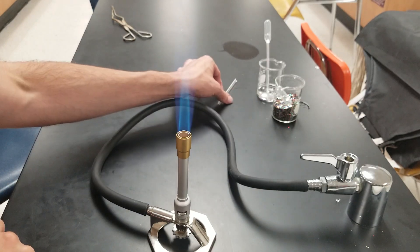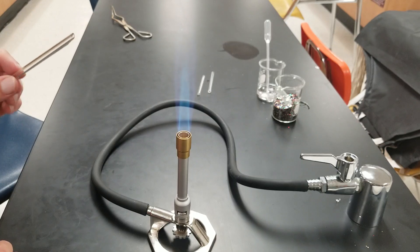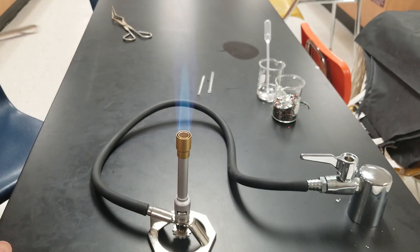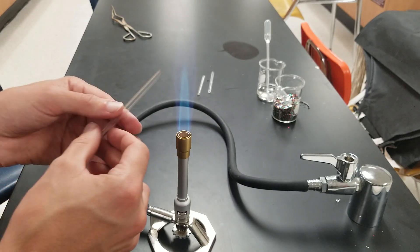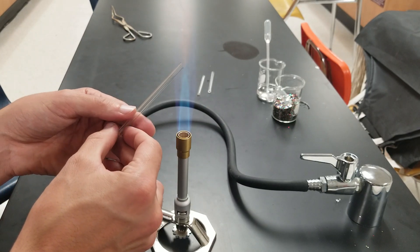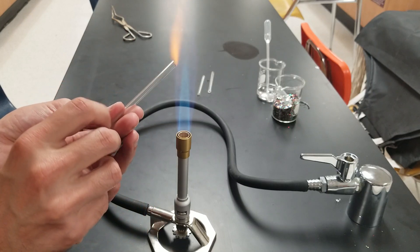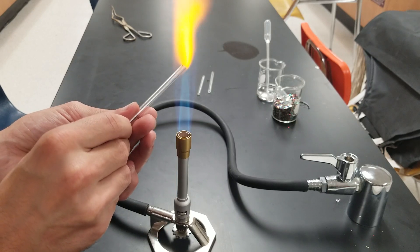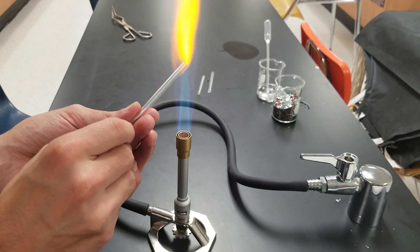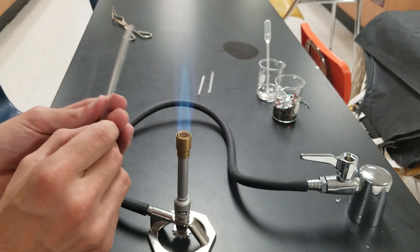What I'm going to do is take a tube like this and fire polish the end — this is kind of a messy end here, so maybe I'll start by fire polishing the slightly cleaner end in the flame. Right here at the top of the inner blue cone, I'll begin. I am rotating it — notice how I'm using one hand to steady it and the other hand to turn the glass. This is the technique for how you go about fire polishing it in order to make it smoother and less likely to cut.